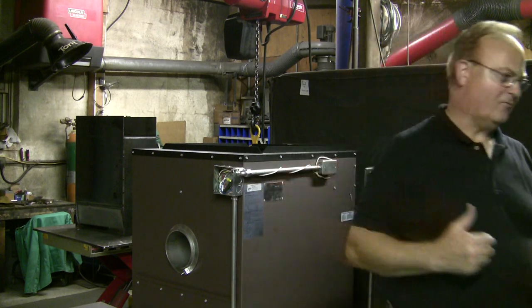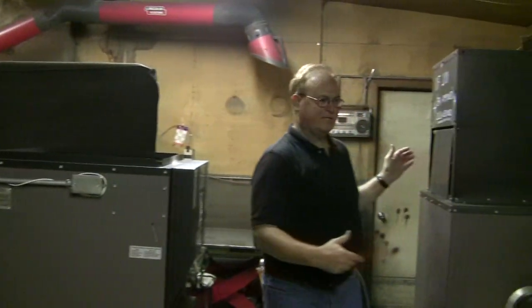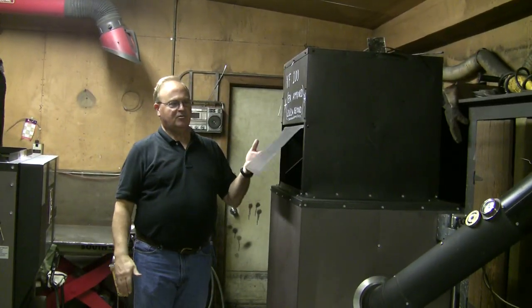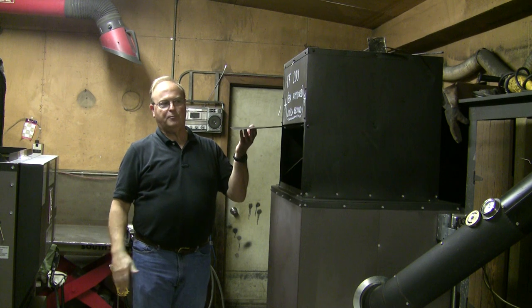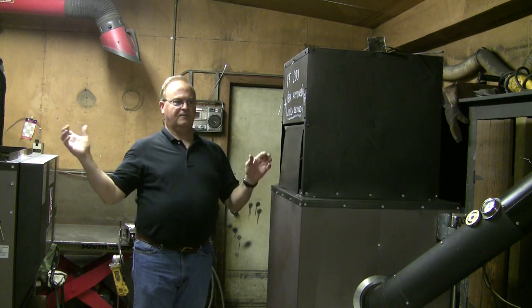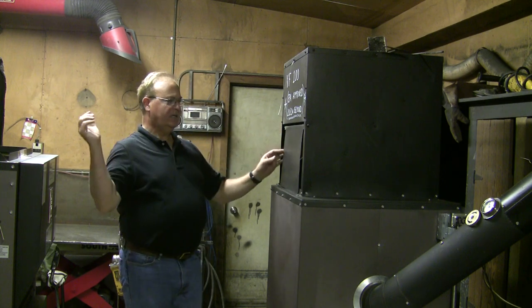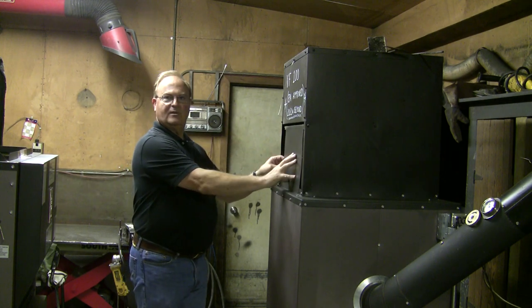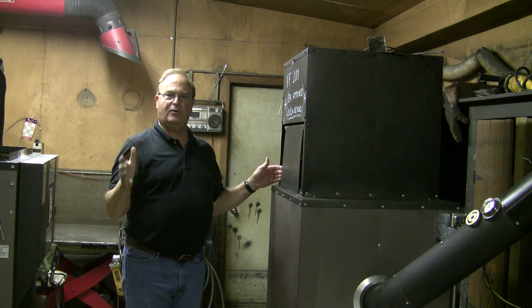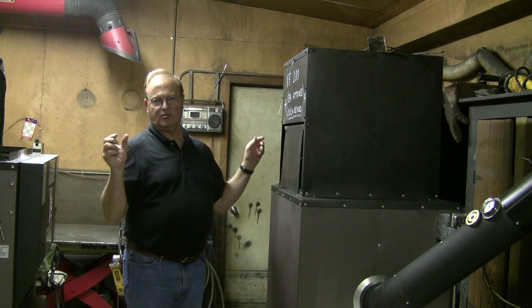And if you want to follow me over here, this is a very crude example, and this is one just going out into the room here. But you'll notice this will flop open, so when the blower on the furnace is running, the air will blow out. But if this was inside your ducting, when the air is blowing this way, you can't blow the air back.